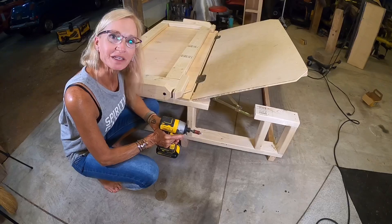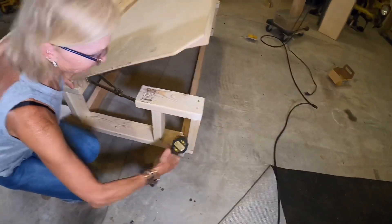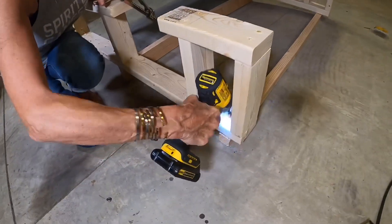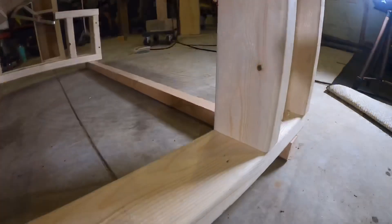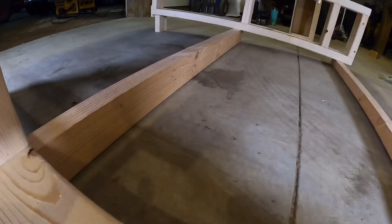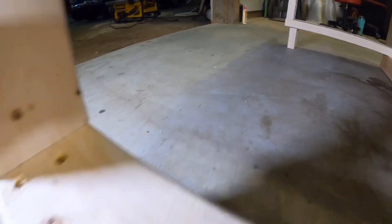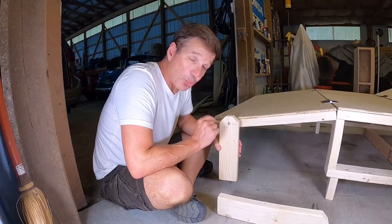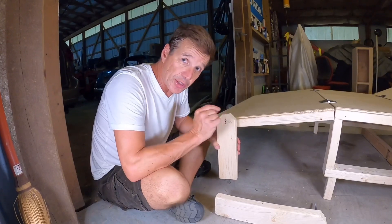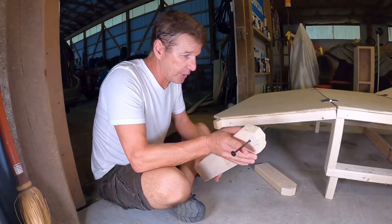Now that we've determined the dimensions for the slope of our van, we simply cut the boards and attach them. The first two braces in the rear go all the way across — they're 48 inches long. The second one is a little bit taller to accommodate for the slope, and the third row is essentially just two stubby ones, which allows you to slide luggage in between. The original leg was too short, so we added the 5 inches measured inside the van to give us a new piece we can now install.